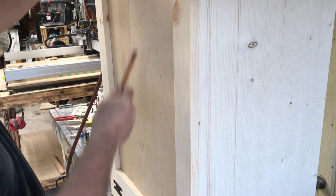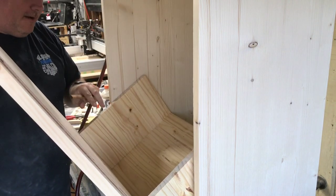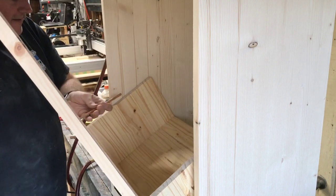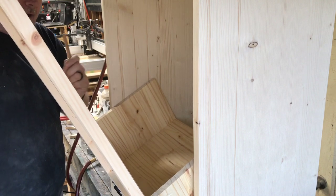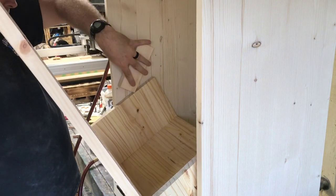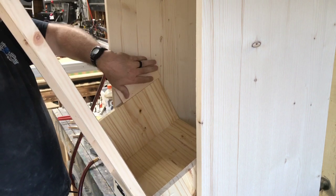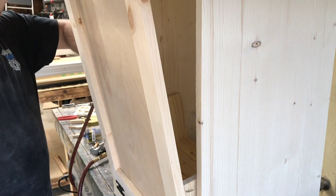I got the hinges on and put a handle on it. Now — the reason I left those braces straight rather than diagonal is that when you open the trash can door, if I'd done a diagonal I'd need some sort of chain to stop it. Instead I'm going to take a piece of scrap wood and glue and brad it to the inside so when the door comes down it hits that stop. Let me find a scrap piece and show you exactly what I mean — I need to figure out how far I want the trash can door to come out.